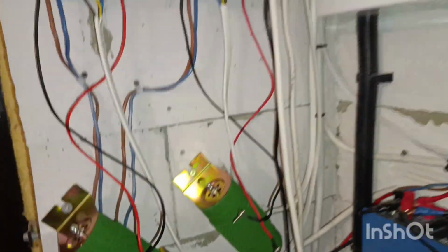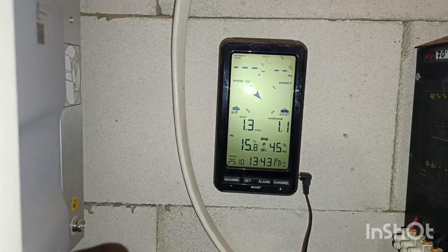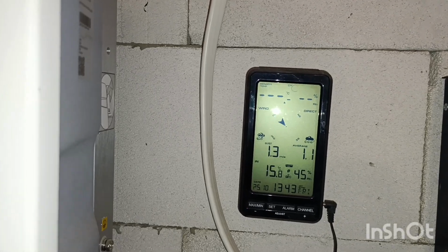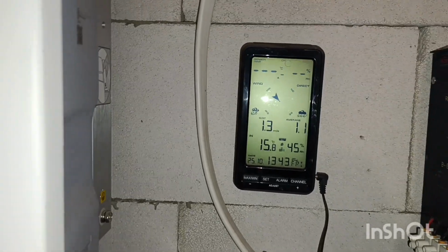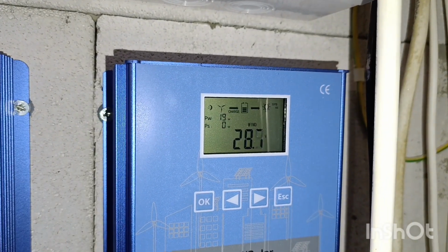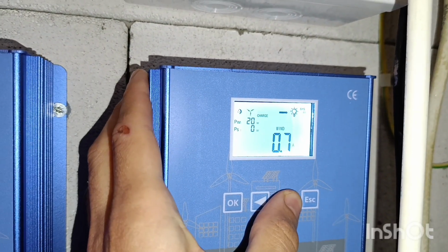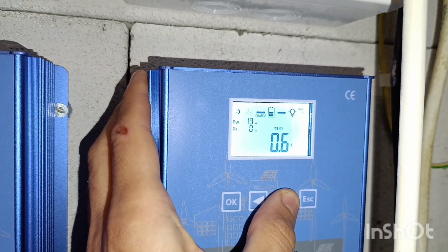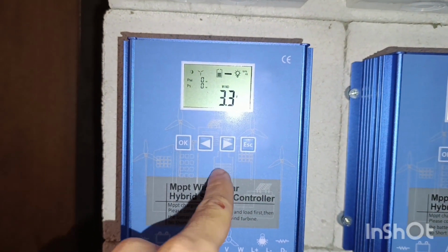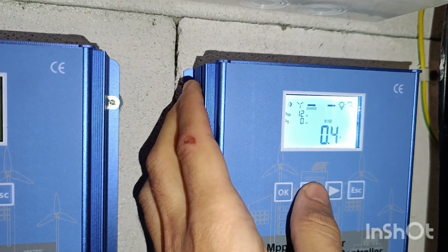In a no wind situation, still 1.1. That was obviously a gust, because this one cannot register everything, it shows something average. It was probably a gust up to 3.2 meters per second. That's my guess. But again, it spins more. 28, 29 volts, and it gets the amperage out of it really nicely. Really, I swapped them and it adjusted the amperage on its own. It doesn't take that many amps out of the tiny S3. I'm shocked. I don't know how they do this.